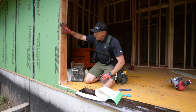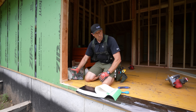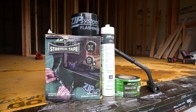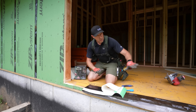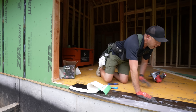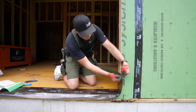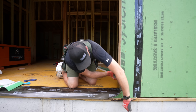So we're prepping out our rough opening. We want to cut to the right size and then start with a really robust sill pan — we utilize the stretch tape for that. The Huber Zip stretch tape allows you to do complex geometries without a lot of weird folds and multiple pieces of tape. We can just lay out our tape, go over the edge and stretch it out. With the legs running up the side, we're in a great position to lap over the top with the regular flashing tape.